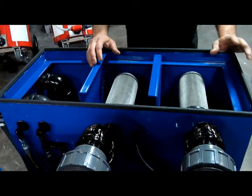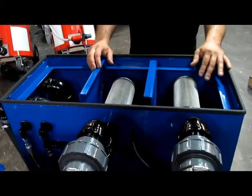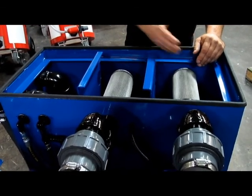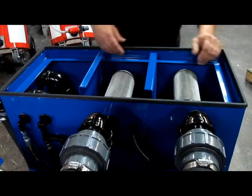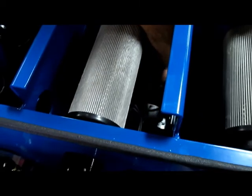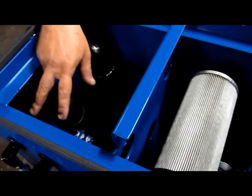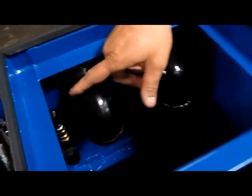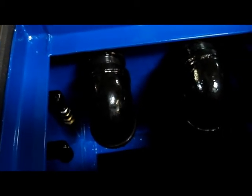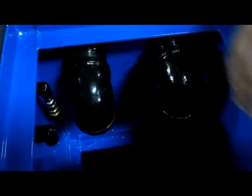That's great. That means you have a wide open inlet for the blower, so it doesn't fight for air out of the tank. That's why we went ahead and gave it 2 filters. That gives you longer days of work. If you look inside here, you have your float, which rises and shuts down the system at 70 gallons. All your discharges are right here, separated. Your DMOD discharge, which controls the heat, has been reduced to a certain size jet to maintain the temperature. And of course, you have your drip valve outlet right here, and this is where your gray water comes in.